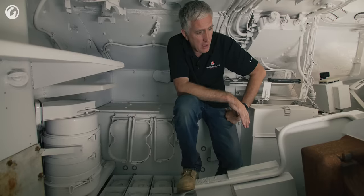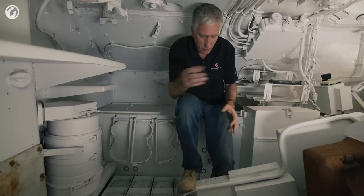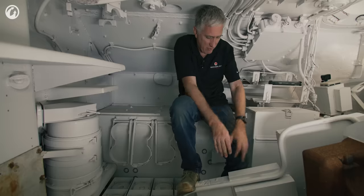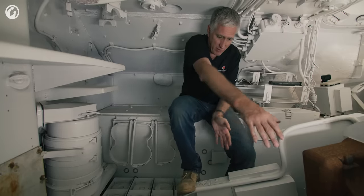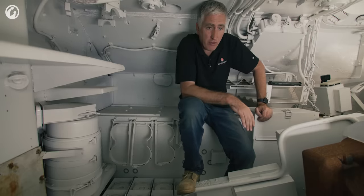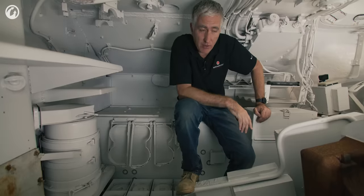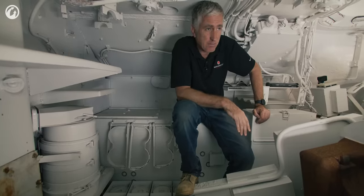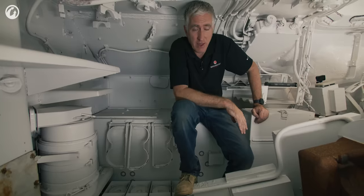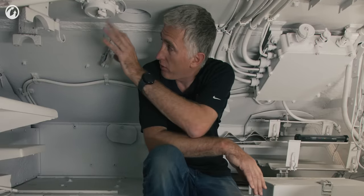And one of the problems was if the gunner had to traverse right, well, he's already the loader, who is trying to manipulate these reasonably sized rounds into the breech. He's already up against the back wall here. If the gun traverses to the right, the aft end of it is going to come left into the guard. The test report notes that if the gun is traversed to the right, the loader needs to work his way around to the other side and then load from the far side of the gun, which at least on the plus side, I can see you got stowage on the far side for propellant and projectile as well. So not the greatest. The blower, as I say, will come up here.